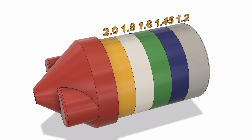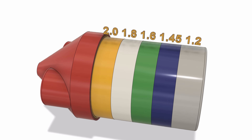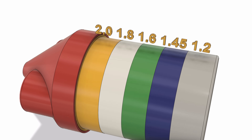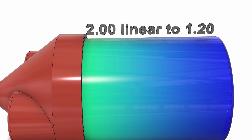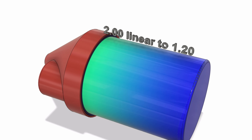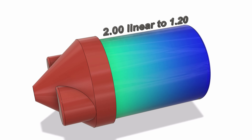That kind of depends on the designer. And if this is someone who is comfortable with defining a material DK in their simulation as an equation-based calculation that's based on spatial area in their design, then that would feed directly into a pure gradient with no steps, which is entirely feasible.